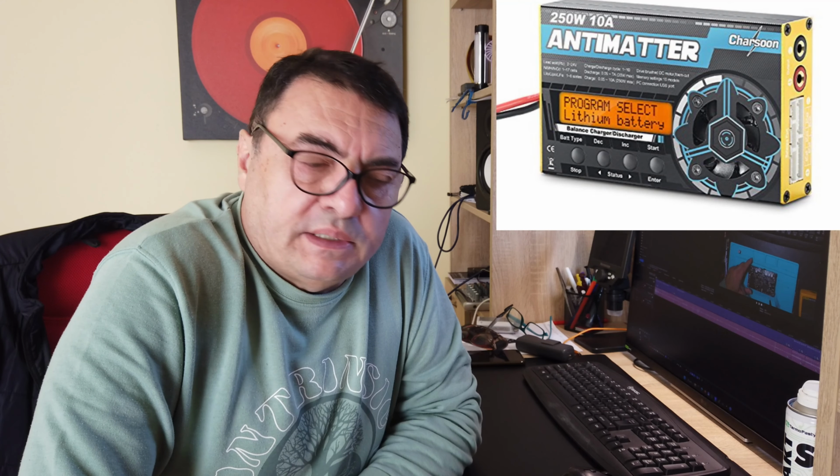Hello again. So today's video is about an attempt to fix a Charsoon Antimatter 250 watts, which suddenly, after a few experiments of charging and discharging lithium batteries or cells, turned up with a connection breakdown display. Well, the machine is already open. I did measure the MOSFETs and it seems like everything was fine with them. I changed the MOSFETs, I replaced the components, but still the same connection break on the display.